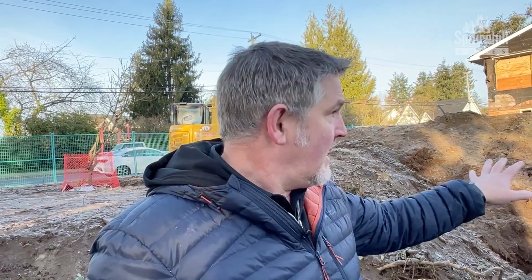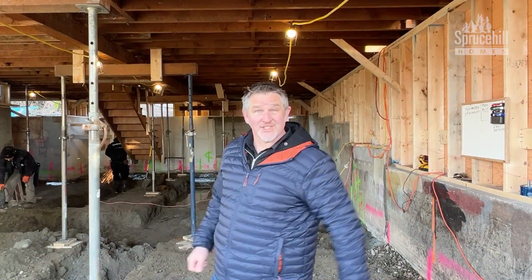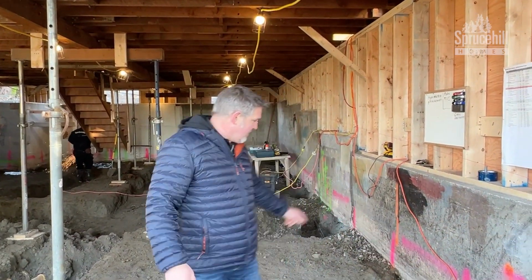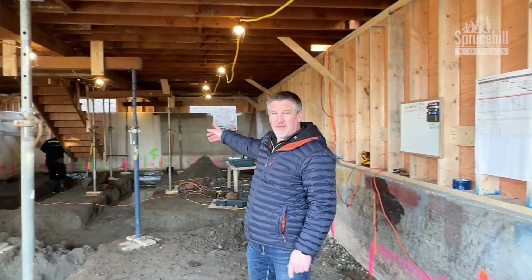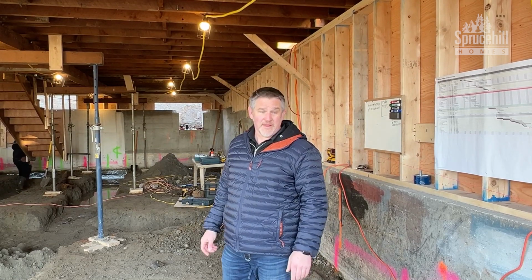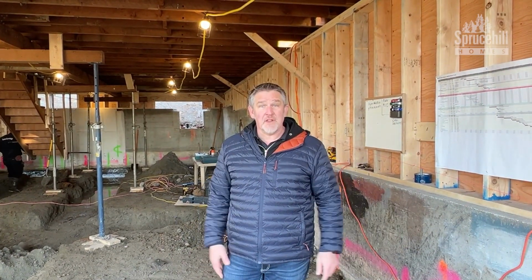We've looked outside. Let's go into the basement and see what the team is working on today. All right, so God only knows if the noise canceling is working as well as I need it to for this right now. Got a machine inside of the house, helping to dig for the new underpinning for underneath all of the walls here. We're getting rebar installed for underneath the walls here. And right now we've got the team working on cutting rebar and drilling holes for the rebar that is gonna attach the new footing to the existing foundation wall. So definitely a bit of a program.